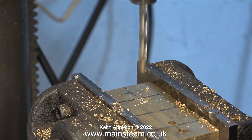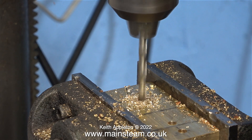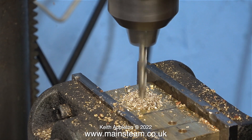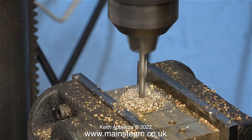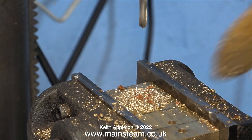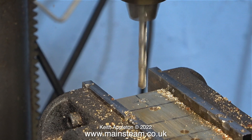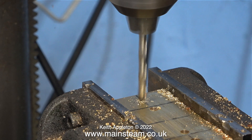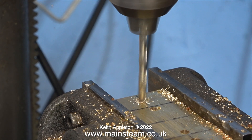I try to always make these videos with beginners in mind, but you can't be a beginner forever, so here I'm showing a different way of drilling holes in a piece of metal. Normally I would use a center drill because from a beginner's point of view that's the best way to get the holes in the right place. From years of experience I can do it by eye - I just gently tap the drill on the work and that creates the center, then I can drill all the way through.